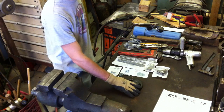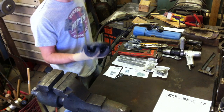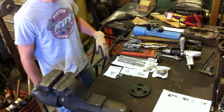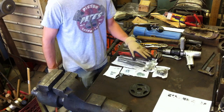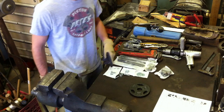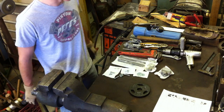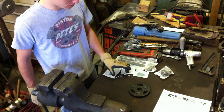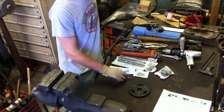It's very simple to build. It consists of a 2.5 pound barbell weight, or 5 pound depending on how much weight you think you need, three 10-inch half-inch steel pipes, three half-inch end caps for the steel pipe, a half-inch T, some washers, some wing nuts, some nuts, some lock nuts, and two one-and-a-half-inch quarter-inch carriage head bolts. I've got a few extra things to make it a little more stable.